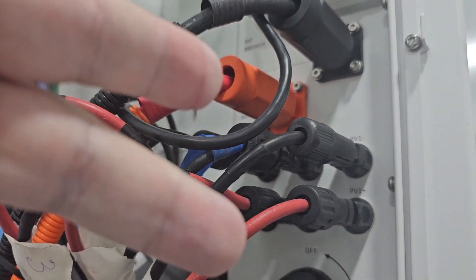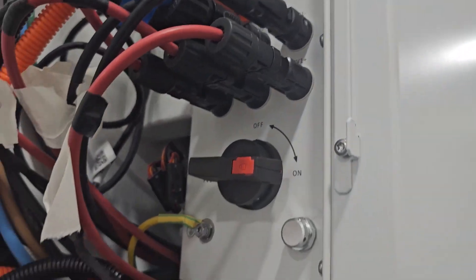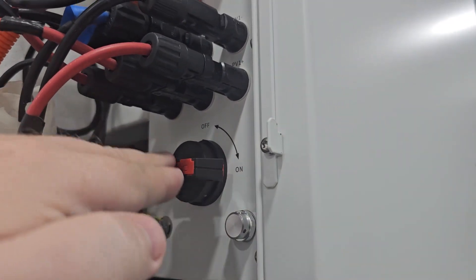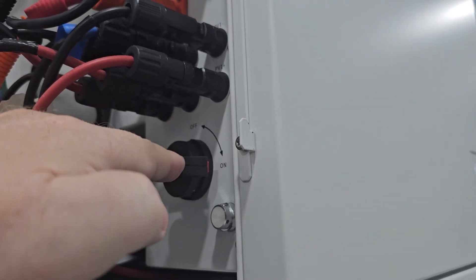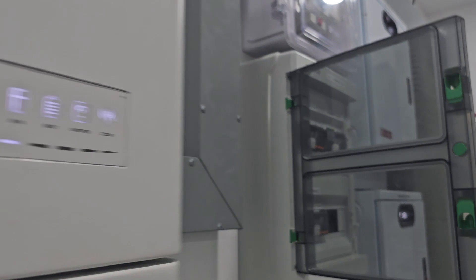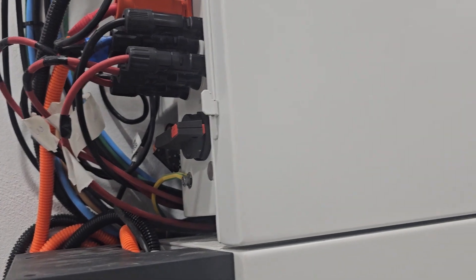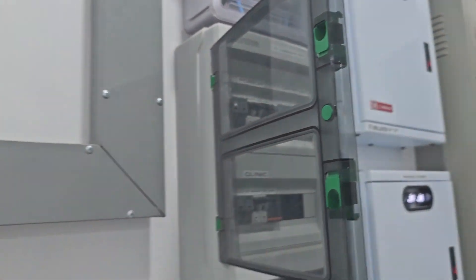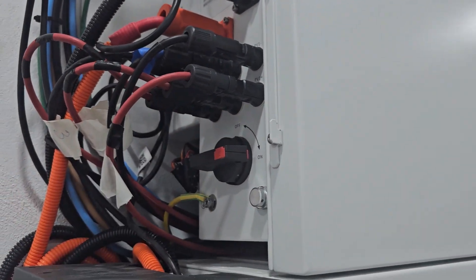So you have one, two, three — that's how they come in. To turn all of them off, you just turn this breaker, which is useful so you don't have to mess around turning them off over there. You turn them off at the inverter if you need a fast way. Of course sometimes you have to close there, but many times it's enough to do only this one — the main DC breaker.